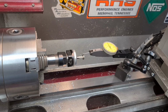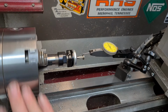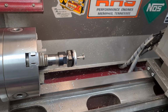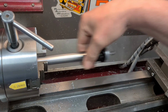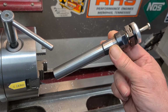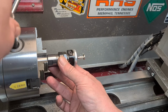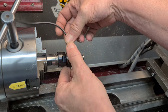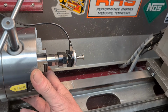So you have to adjust the run out of the probe. This one here is okay. And I put the probe in an ER16 holder, so I have a physical stop always the same at the front of the chuck if I'm installing it. And you should always install it in the same orientation, so the run out will be minimal, with minimum changes if you reinstall the probe.